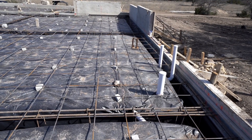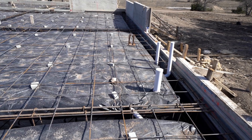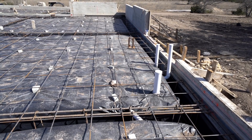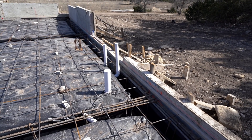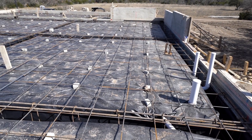The mat rebar is number 3 at 12 inches spacing. In the beams we have 3-quarter inch rebar, which is number 6 rebar, top and bottom. Stirrups are at 21 inches and these are number 3 stirrups. The beams are 12 by 24 interior beams. The perimeter beams are 12 by 30 — that means they are a foot wide, 30 inches deep. The beam spacing is about 13 to 15 feet.